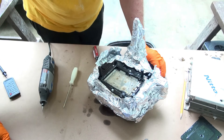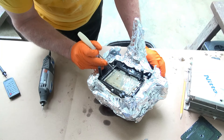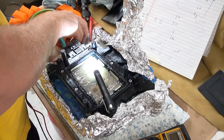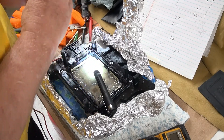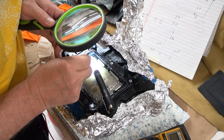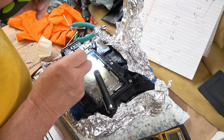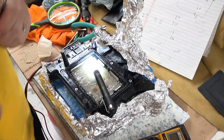There are my connections and I can see the number 2 wire right there. I've found that this second wire is disconnected — it's actually disconnected from the PC board. There's a silicone potting compound here that I'm going to have to carefully work out of the way. I can see the end of the wire and it's loose and free. I need to carefully remove the potting compound to determine where that wire is to be soldered on the board, and once I can solder it back I believe that will repair it.